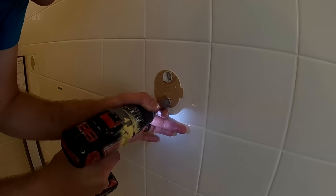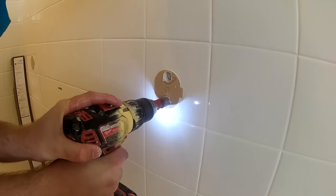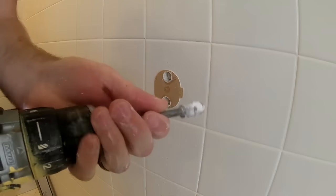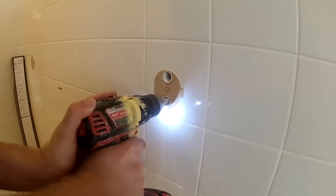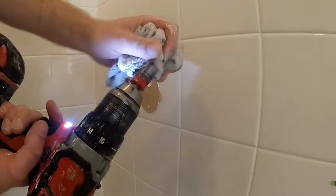On this one I'm drilling through the tile, and what's behind it is drywall. I'm drilling through the tile on each hole, then coming back with the Apache drill bit just to finish through the drywall, because the Apache drill bit works great through drywall and ceramic tile — but not porcelain tile. I drilled through, hooked up the Apache drill bit, and went right through the drywall. As you can see, there's no stud behind there.